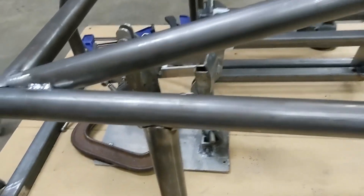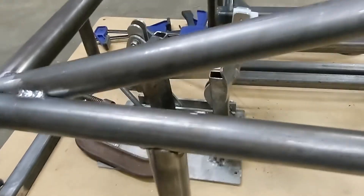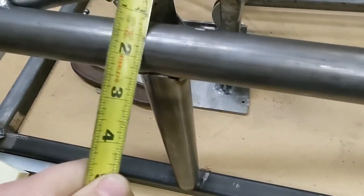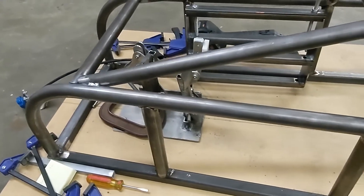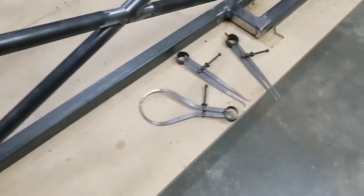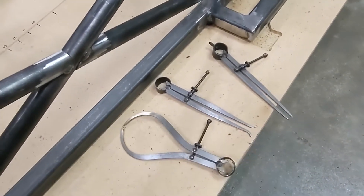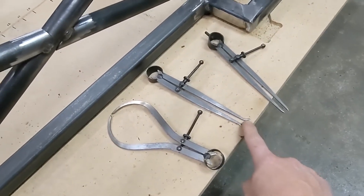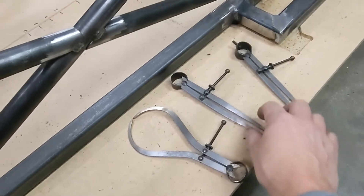So I want this thing tied together — there's a little tiny tube that's going to go right here. The question is how do you measure and cut and install that tube? I could try to use a tape measure to roughly figure out the distance. I've developed this process using these harbor freight dirt cheap little calipers. I have a couple different ones: this one for point-to-point, this for inside dimensions (IDs), and this for OD dimensions. They're super handy.